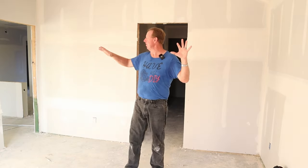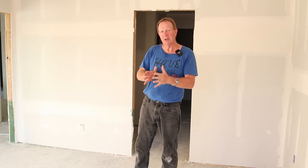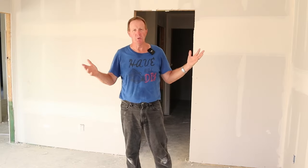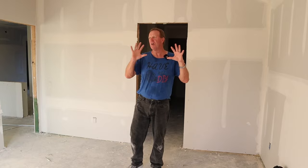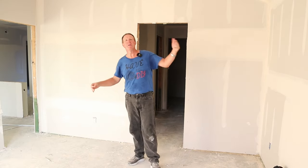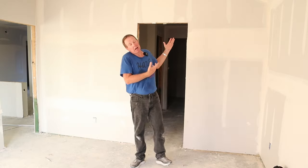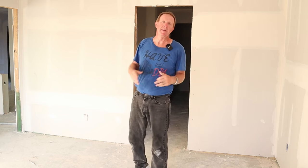Typically what you're going to have on all your interior walls is half inch sheetrock, and in between the garage and the interior living quarters it should be five-eighths fire rock — that's pretty much code. You can see in this house they've started; they've got the first coat of drywall mud on the seams and the nail heads. As far as finish on your walls, do you want them smooth or textured? It'll cost a little more for textured, but personally I like textured.